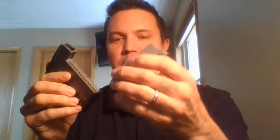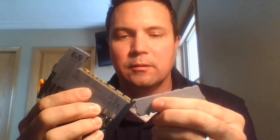This is just a digital input card, a six channel. What you do is you basically slide them in — slides right in. And you'll notice there's a terminal block that comes with it as well that you can tie all your wires into. It kind of has a hinge here — you put that on there like that, swing it shut, and then you've got it all set to add on to this controller.